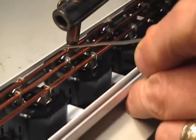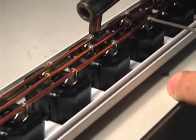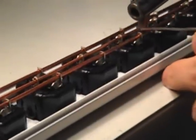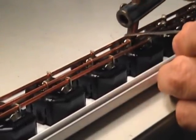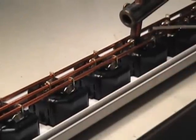We want it to cool a little bit before we let go, so there's no vibration. You can see we get a pretty good run — one consecutive joint after another. You can see it's pretty consistent. We control the amount of solder that's going on there, and it's really rapid.